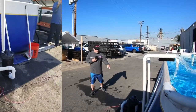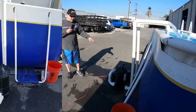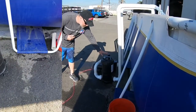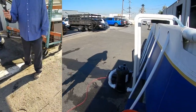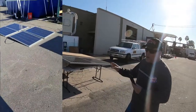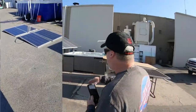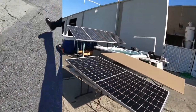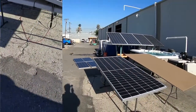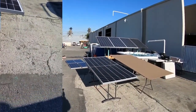We are showing off our half horsepower Sunray Solar Pool Pump with Advantage Manufacturing 75 square foot filter. Currently we're running it on one solar panel — one 390-watt panel, 48 volts, 9 amps.